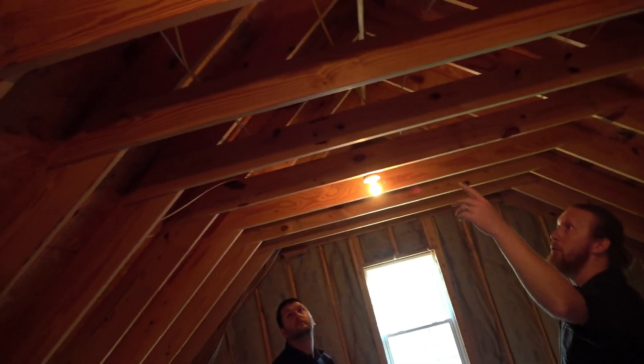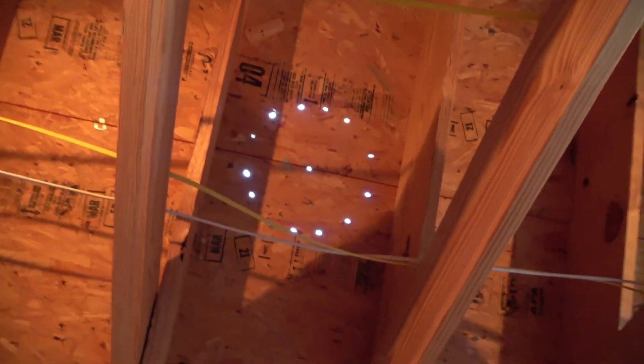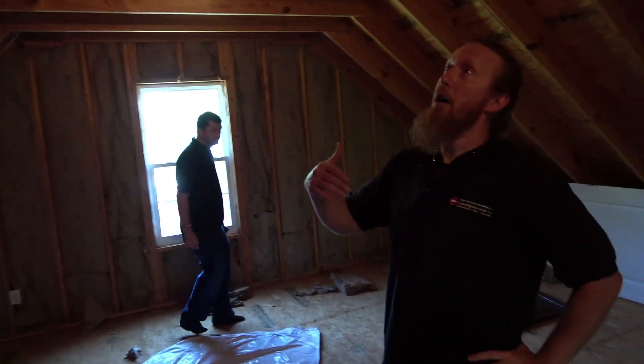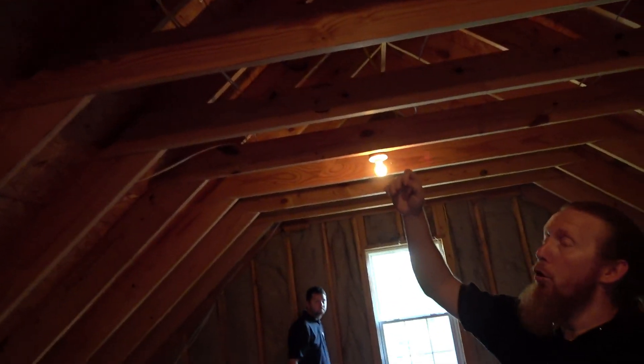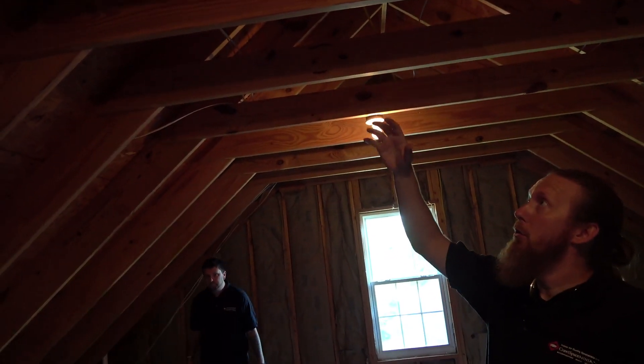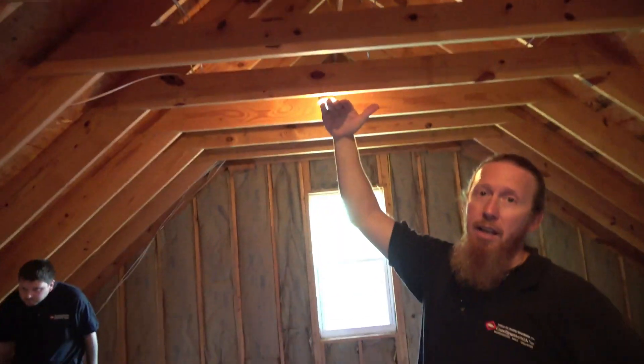In the peak above us we're installing two solar attic panels. Here's the solar template — it shows the hole we're going to put in for the solar fan. The nice thing about our solar fans is they have a thermostat control mechanism. In the winter, there's a sensor that dangles inside the attic — if the attic gets too chilly it does not turn on. It's set at 70 degrees, which is really nice, so you don't have to worry about these solar fans kicking on as soon as solar hits.